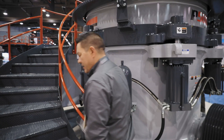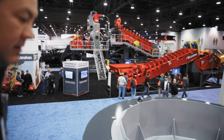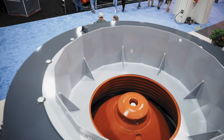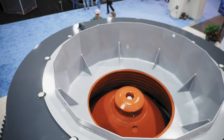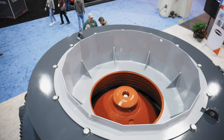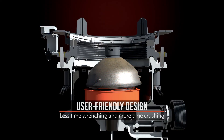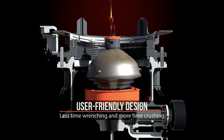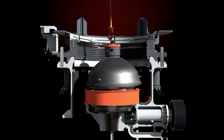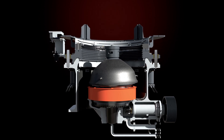We'll go up and take a look inside real quick. This is a big machine capable of taking big rock. This particular setup inside this machine can take up to about a 15 inch rock and then we can close that down to creating an inch and a half minus product. That's a 60 inch cone head in there, so it's capable of doing a lot of work — you can push some serious tonnage through this machine.